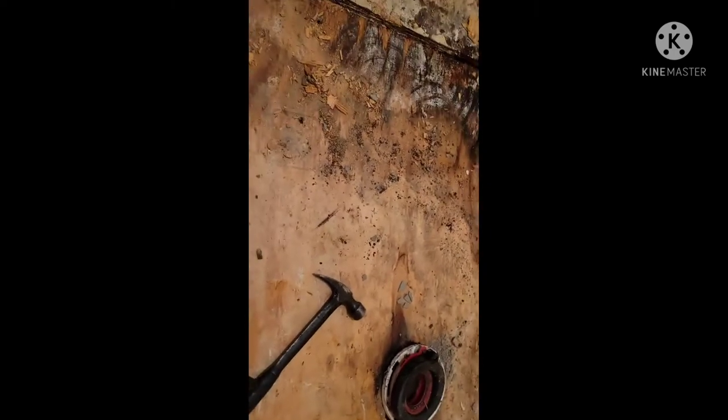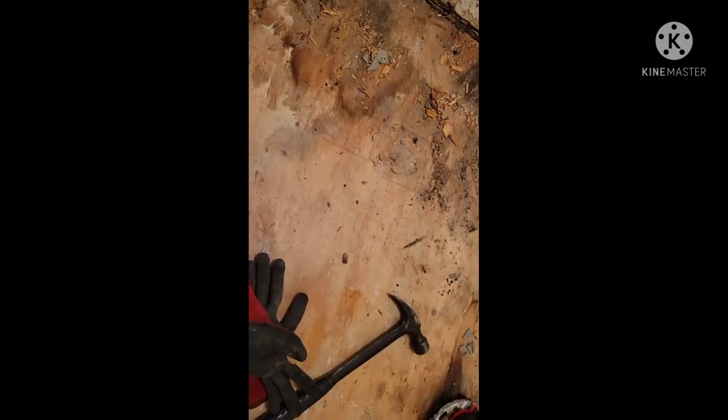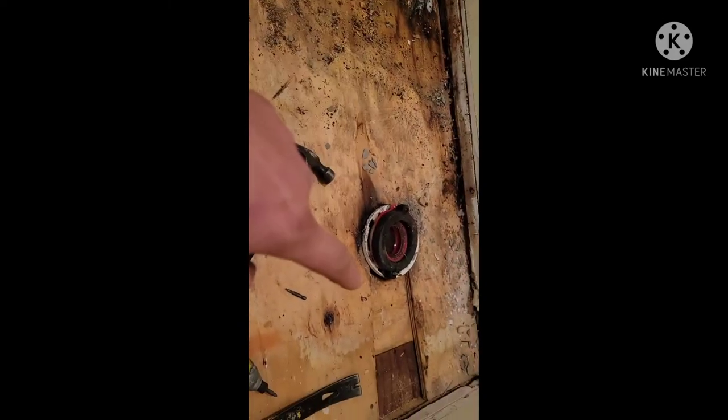I managed to get this little patch piece here around the toilet out. I pulled one piece of plywood up - there's another floor, which we knew. Then I pulled a little patch piece up and look, there's yet another floor. They cut along the wall. I think I need to peel all of this out because all this is full of mold - it's all got to come out. I think we can see all the wall sheathing underneath it.